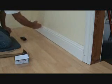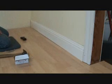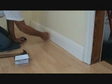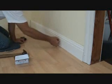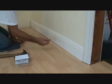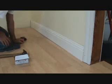I mean, there's the studs every 24 inches or 16-inch centers. Usually at 16-inch centers, but how do you find the studs? You can't just nail this wherever, because if you do, you're just going to nail right into sheetrock. Okay, and since we're doing this by hand, there's a certain way we've got to do it. Obviously, we're going to have to find the 2x4s, right? The studs.